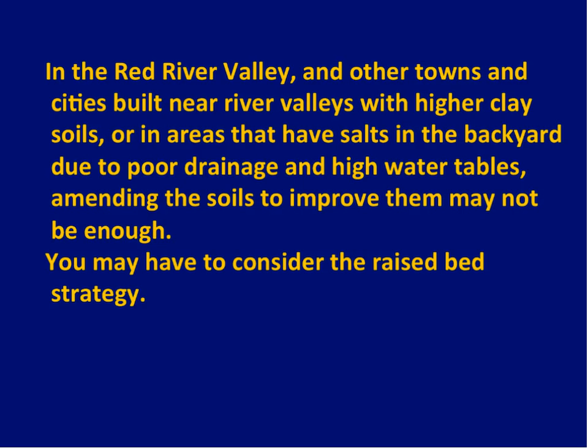Really high clay — 45 percent or more — causes foundations to have to be thicker. We have two kinds of concrete in the Red River Valley: concrete that's cracked and concrete that hasn't cracked yet. These soils can draw water through capillary action from deep depths up toward the surface, so in a drought our soils are very protected, but in wet conditions it's really, really horrible.